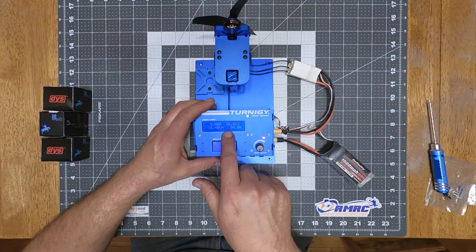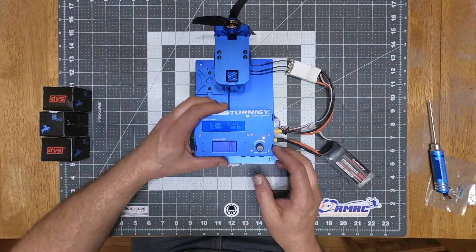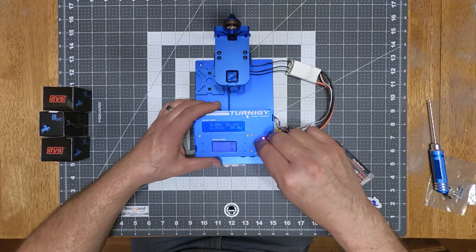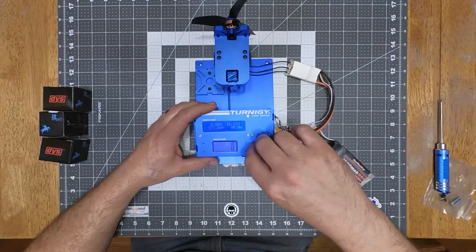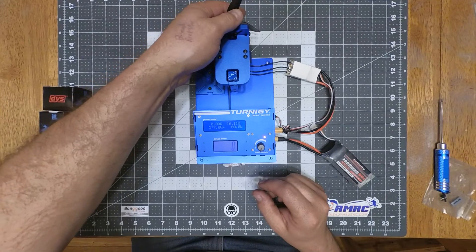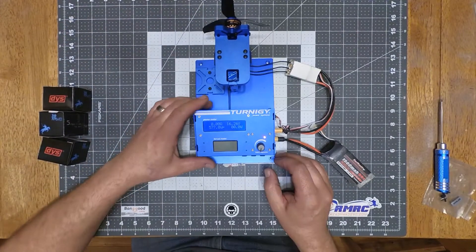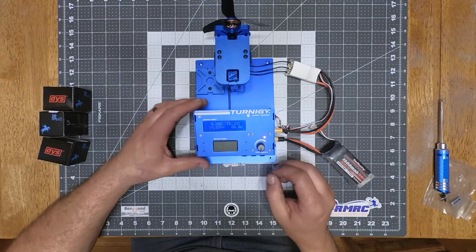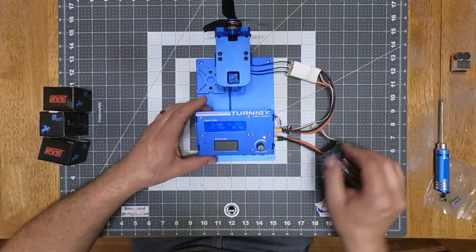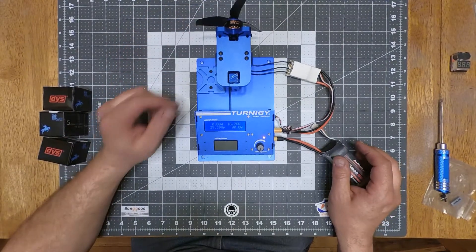The only difference is that this pack is down a little bit — it's at 16.4 instead of 16.8 or 16.7. I'm going to go up slow and then go full throttle. Let's see if we can get a clean one. That's pretty crazy. The motor is a little bit warm. I don't know how much of that you'd want to subject it to, but that was like 1,300-something grams of thrust — I'll put it up on the video. It's quite a bit; it's pushing it with that prop and that ESC.